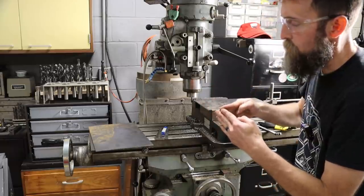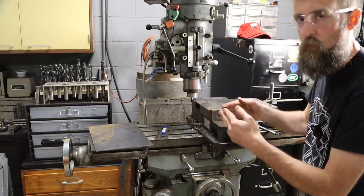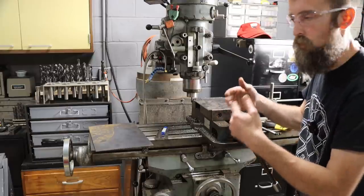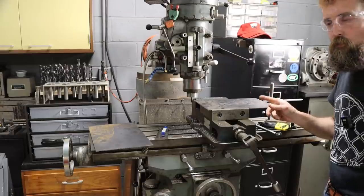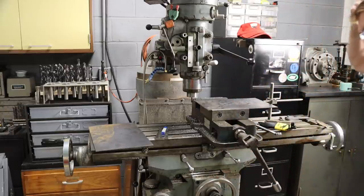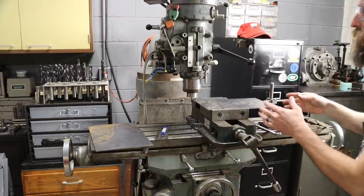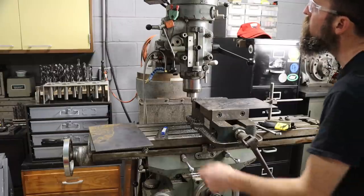And this is going to be a weldment, so we're going to rely on those ends when we weld this thing together, at least partially, to locate where they need to be. So if they're the same length and they're good and square, it makes things a lot easier on the assembly. So that's what this is. It's just a repeatable setup to give me plates good and square and of the same length.